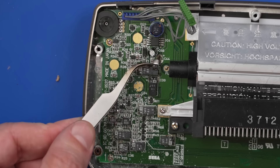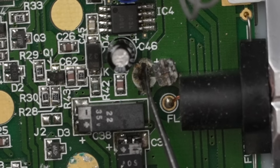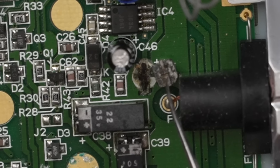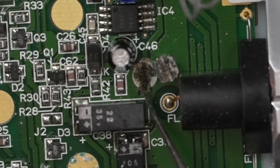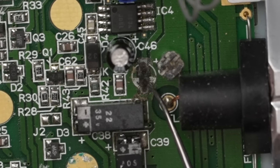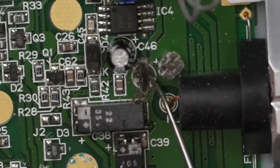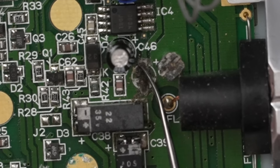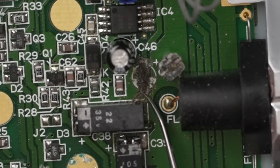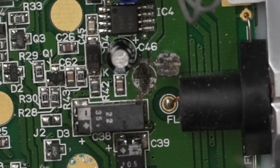It's just crazy that that capacitor came off the board. There are the pins on the board and there's the capacitor — totally corroded away, a little crunchy in there. I think these pads are okay, but once we get our hot iron in here we can really see if that's true or not. We're going to have to really scrub on these pads to get all this corrosion off so we have something we can solder to.